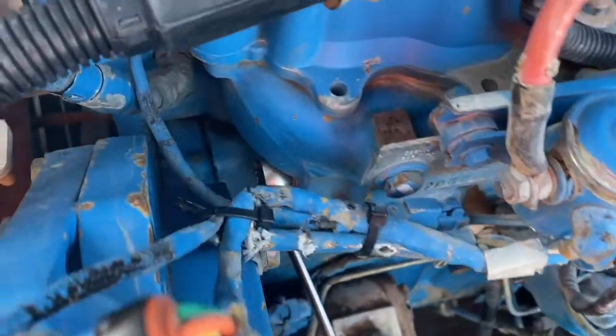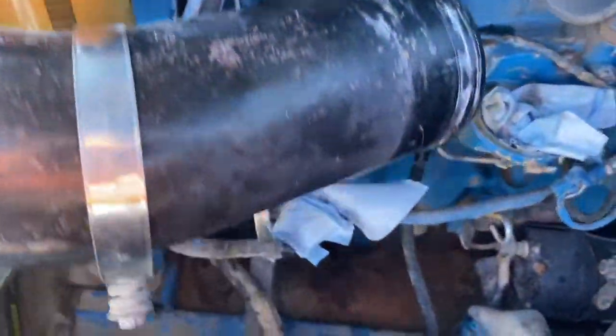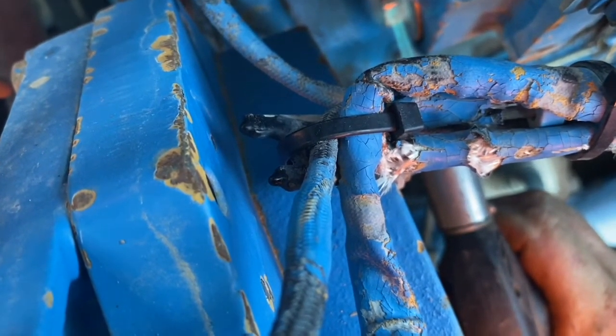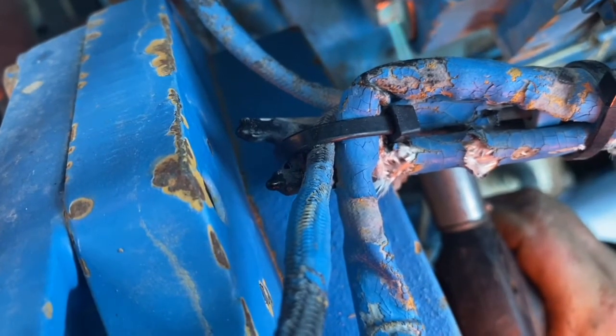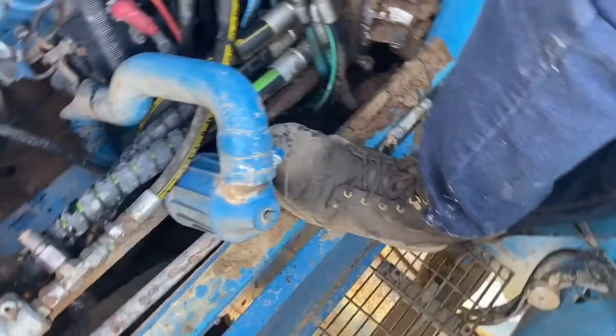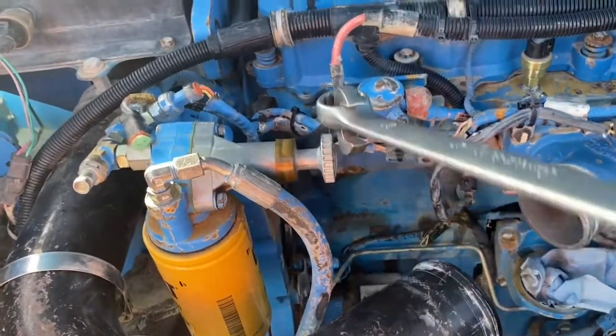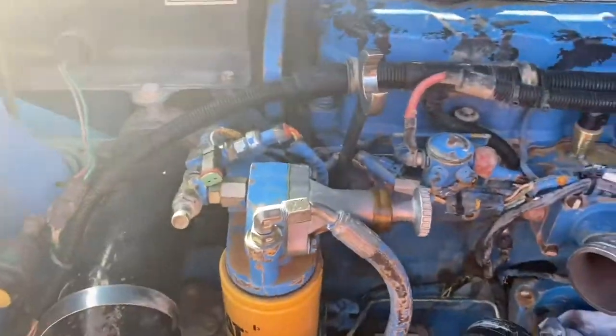So this is where my oil leak was coming from. It got all gurneyed down before we pulled it apart, but we're pretty sure it's leaking out of this plug. Now these plugs are on real tight. It takes an inch spanner, and I put another spanner on there and I still couldn't crack it, so we're going to put a bit of heat in with a blowtorch, try and heat the fitting up and loosen it a bit for us. So I put 2 spanners back to back because you can't get a socket in there with a ratchet or a breaker bar, and it cracked eventually.